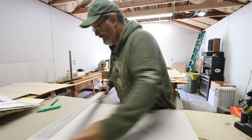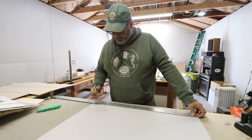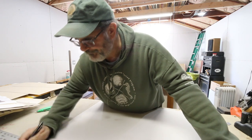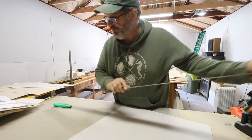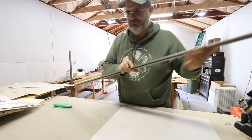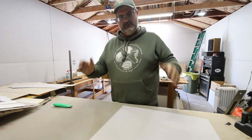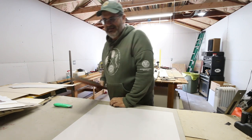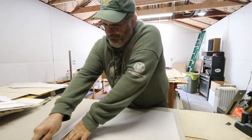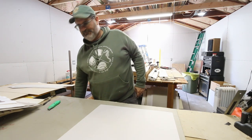We're going to make this one an inch less because this is going to be the second mat — it's going to have the white space below it. So it'll be 24 by 21. The reason you cut it shorter is because you use the first mat as a guideline to your second mat. All of your outside edges will be on the first mat cut, which is the wider opening. The second cut is going to be a quarter of an inch in, making it the second visible mat that you see as a double mat.